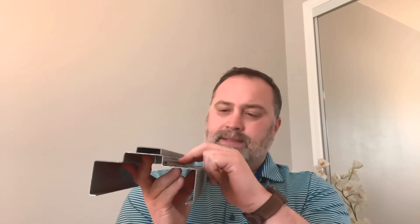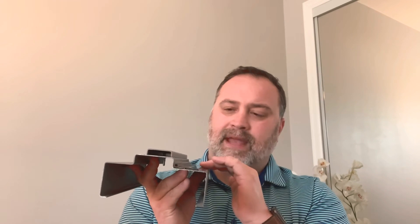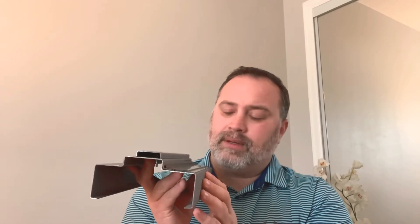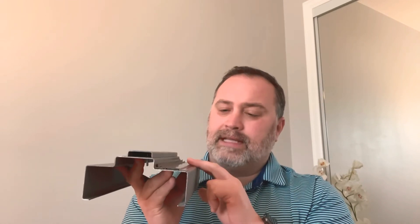The next piece is this one right here. This piece of gasketing is used whenever the door is in the closed position and the edge of the door has an excessive gap of over one eighth of an inch where it meets the rabbet of the frame. This will remove any gaps up to five sixteenths of an inch.